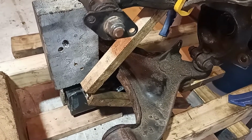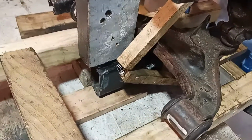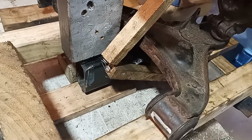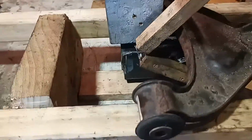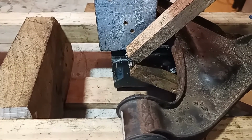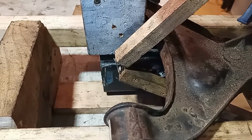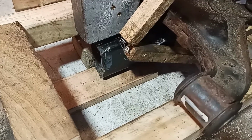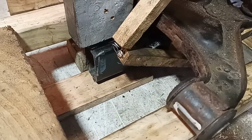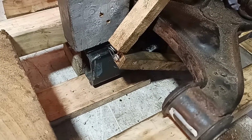A pull rod, angled at about 50 degrees, comes down and joins an arm, which then latches onto the torsion spring. The arm would be about 90 to 100 mils long, and the angle here is approaching 90 degrees and could even be 90 degrees, which means that as the suspension rises, it would go over 90 degrees and become a rising rate suspension. Rising rate because the pull rod would get less leverage advantage over the torsion spring as the pull rod moved up and the angle changed.